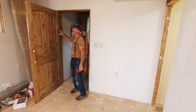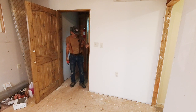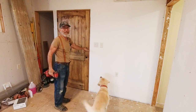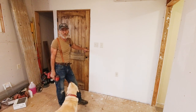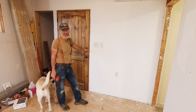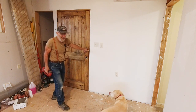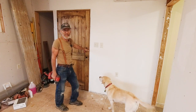It was a very snug fit, just like I thought, both for height and width. I put three screws in each side just to test if it would even fit. If I were building furniture I'd be pretty proud, but since I'm hanging a door and would like shim space to get foam behind it, I'm not quite so happy — but it fits like a glove. No shims, and just six screws holding it in place so far. I've got about a half-inch clearance on the bottom, and the flooring I'm putting in is five-sixteenths, so I may not even have to trim the bottom.